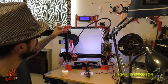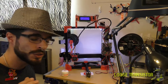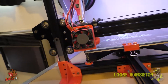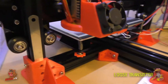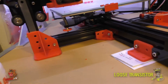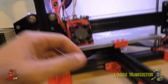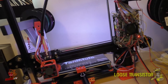Make sure the eccentric nuts are pressing against the rail evenly throughout, and that everything is square. I've already printed some upgrades — you can see them here — that help stiffen everything up and hold it together nicely. Another upgrade you're definitely going to want with the Tevo is a parts cooler. It makes a whole lot of difference in print quality — much better finish and much better detail — and it should be easy to find something on Thingiverse. There are other upgrades too, like a base that helps put everything on more even footing. I also have some paper and these little leveling helpers to make it easier to level the bed.